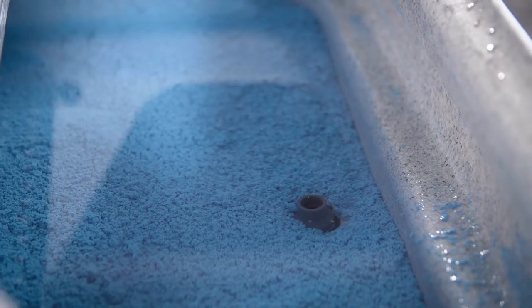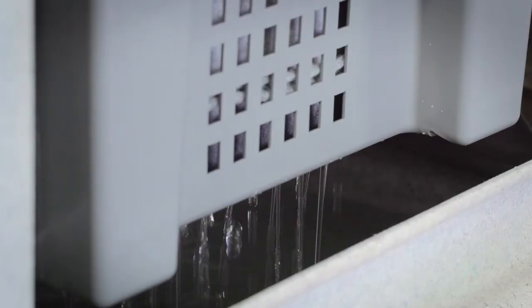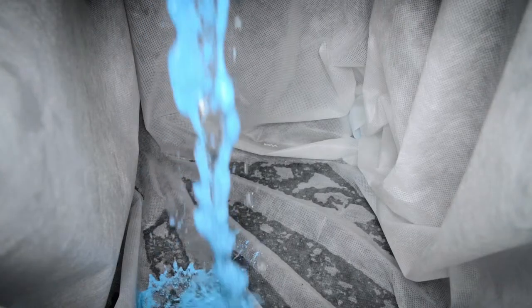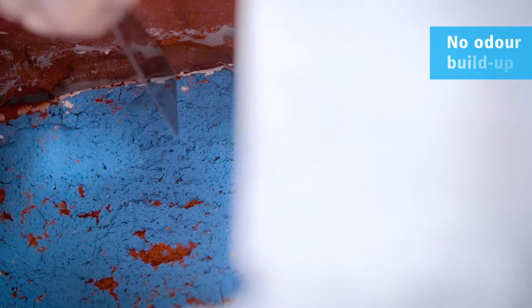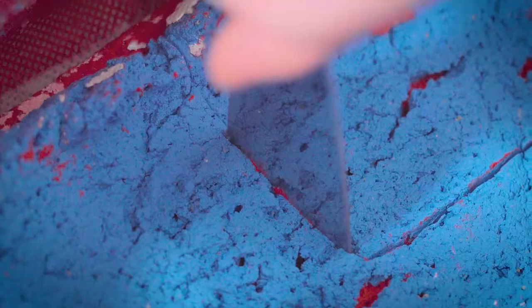After 15 minutes, you will see that solids and water have separated. First, the clear water will be discharged via the filter, followed by the resulting colored sludge. The filter system ensures speedy drying of the colored sludge, removing the basis for bacterial formation.